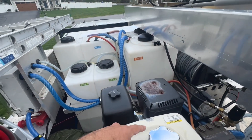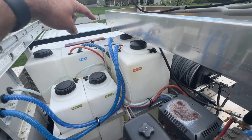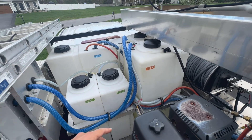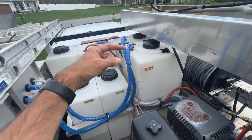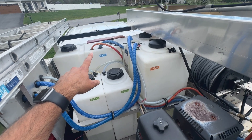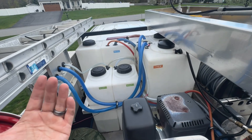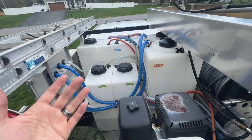I have a hose reel over there. If you've seen the tour video of this truck, it's right about here on the outside of the truck. It goes through that faded red line, and there's a float valve in there. It runs through a little strainer first and the water dumps into that tank. When I'm ready to use it, this blue line right here goes to the pressure washer. This one — where my finger is — goes to the blend manifold and then onto the pump. The other faded red line here is my return line off of my external unloader, and there is a small quarter-inch line right about there that rinses my chemical injector out. The buffer tank is where the water from the incoming source — the house — goes in, runs through a filter, settles in there, and I draw off of that.